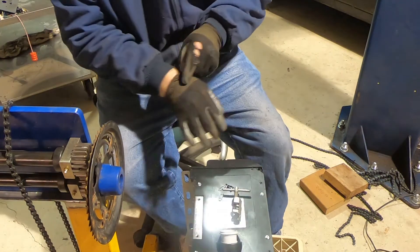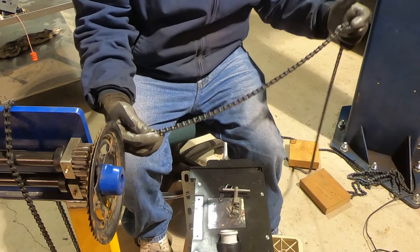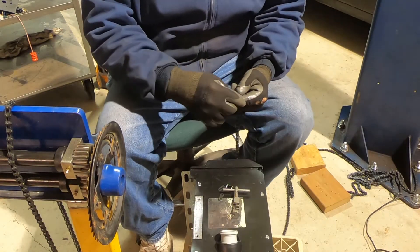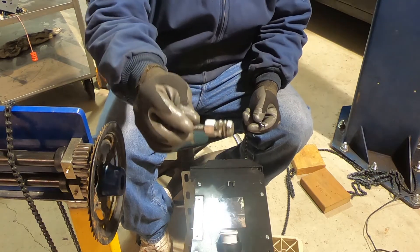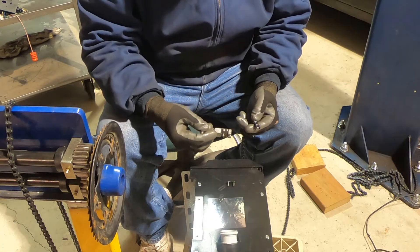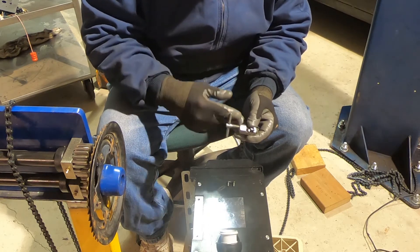So we got our chain made. To make the chain, I just simply took a piece out of the garage door opener chain. And to do that, I used a chain breaker. If you haven't used a chain breaker, this is what it looks like. It's just a simple little tool — you can pick it up at the bicycle shop. Basically, all you do is you just set your chain in there and then you just screw it in.